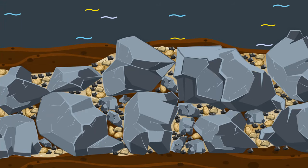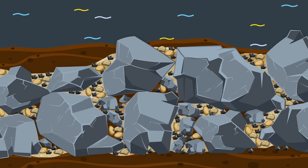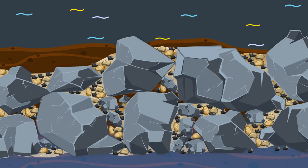No bedding material is needed for VFR since the mixture of cobbles, gravels, sands, and soil filling the voids functions as an internal filter to prevent piping of the subgrade.